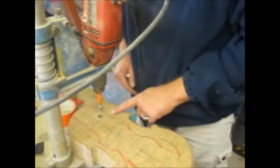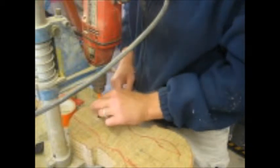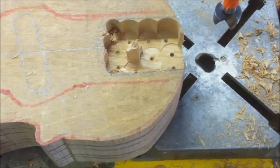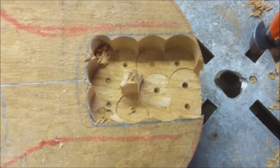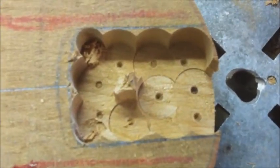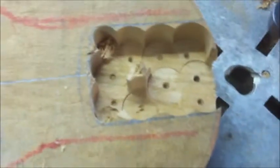Now what I've done, I've drilled a little bit with a smaller one. You've got to go steady and slow because they do get hot and if you get too hot it'll ruin your drill bit. So really steady and slow. I'm going to drill this out now and give you an idea what I've done after. So I've basically gone through it with a drill bit. I've drilled up to my line, almost down to my depth, and what's left I've got to do behind with a chisel.